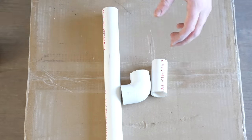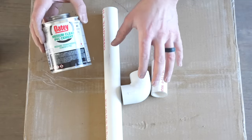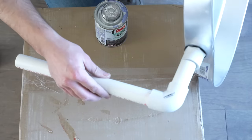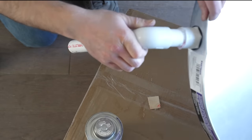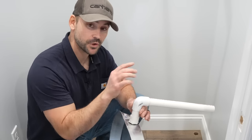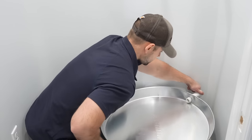I'm going to glue all three pieces together using medium clear PVC cement. I'm not going to worry about primer because this isn't a true plumbing joint — it's just a simple drain. I'll now glue this into the drain fitting on the pan, making sure it's pointing down and going straight through the floor. If you're installing a hot water tank in a basement, you'd just route this to your nearest drain. I'll place this down through the hole and get it flat on the floor.